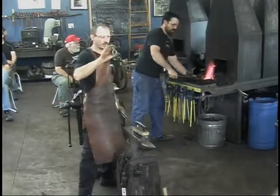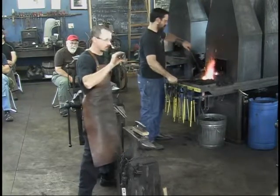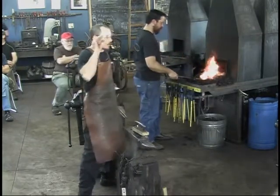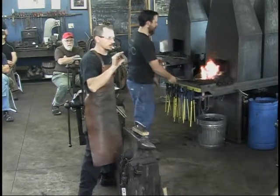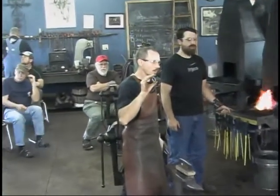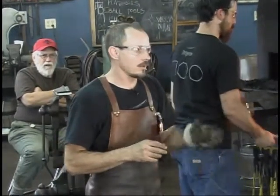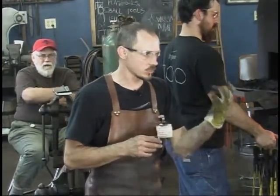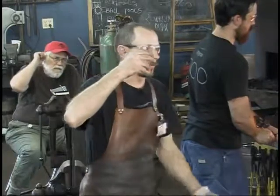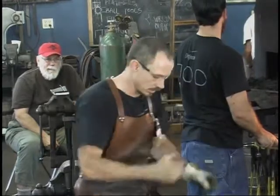Like I said, I'm very fond of working with a ring locked on my tongs all the time, especially power hammer work, but even work at the anvil. It's gonna save you in the long run. Gripping the tongs all day long is really tough. The one time that I do not like using a ring like this is when I'm quenching steel. I was putting tongs in there, locking it with the ring and quenching steel in water. And as it goes through that size change, as it shrinks in dimension as it's cooling, I have had things loosen in the tongs enough that the whole thing fell out. So that's the one time I don't use a ring on my tongs. I have a good grip on there when I'm quenching the steel.